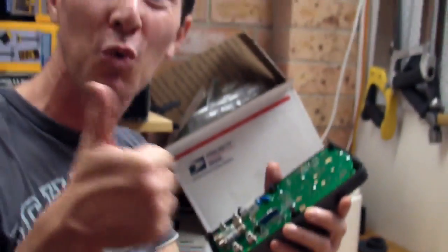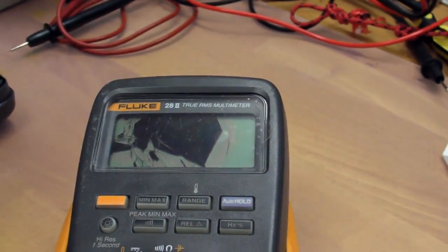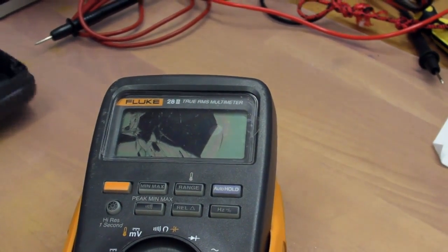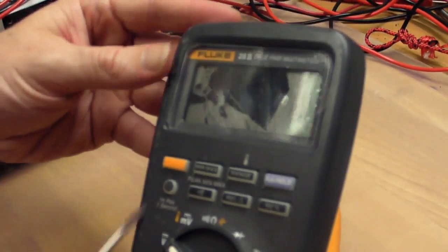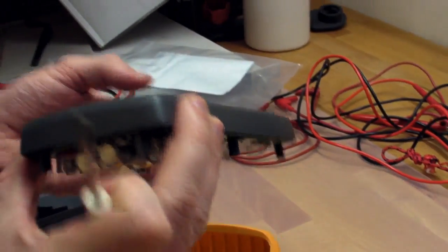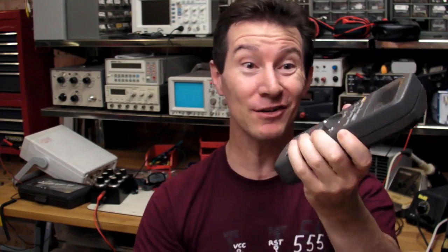Awesome! I can't believe it — that was from 12 meters! The top polycarbonate protective cover hasn't smashed. This still has the protective film on it — I could peel that off and the top cover would be as good as new. There are a couple of scuff marks where it's impacted various things, some silk screen worn off from the canyon, but the case has not cracked at all! I put a new LCD in it and replaced the inductor, and what do you know — it works!